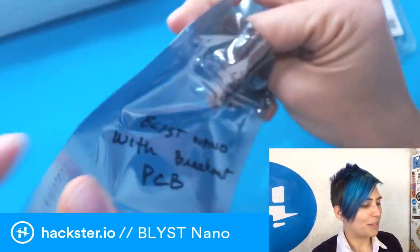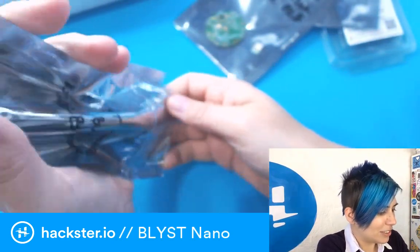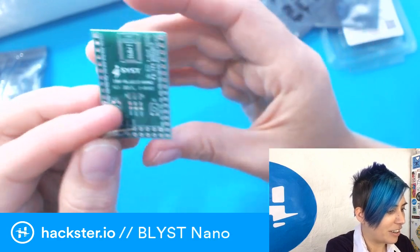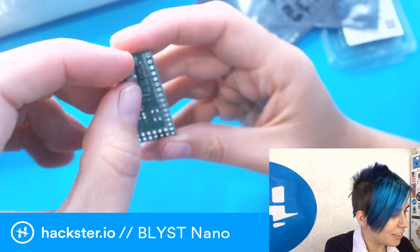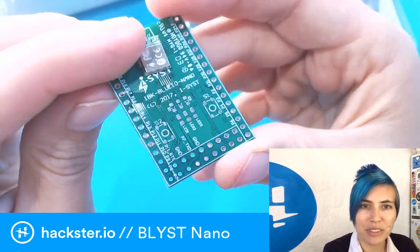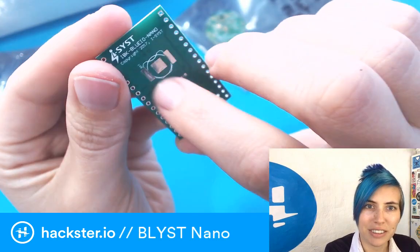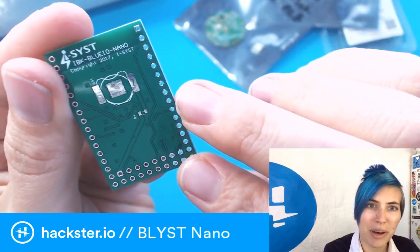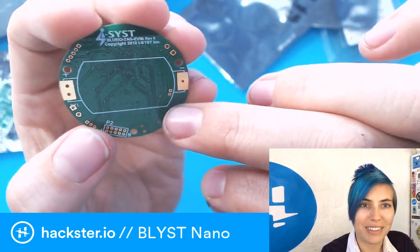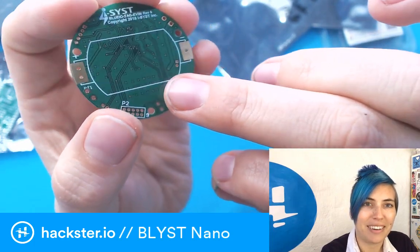And there's also this other, more regular sort of PCB breakout. You've got this guy going here again, and it's just a more general sort of breakout. Both of these are programmed with a JTAG debugging connector. Here's a little coin cell battery holder — it's not just any battery though. This one's got a huge one because it's a chargeable manganese lithium battery.